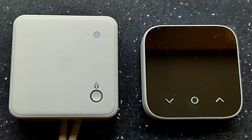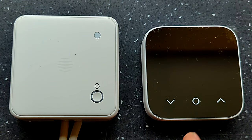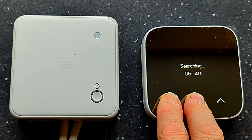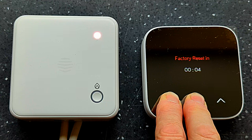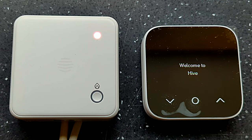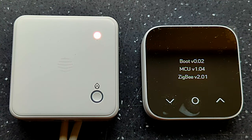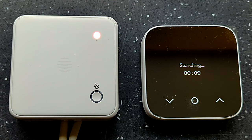Now if you can't get the two units to connect together, here's how to do the factory reset. The receiver unit is already in pairing mode — the light is flashing that purpley-white color, one second on one second off — and you can see the thermostat says it's been searching for over six minutes. All you need to do is press and hold these two buttons together. In red writing you'll see it says 'Factory Reset' and it counts down 10 seconds. Keep your fingers on the two buttons until a Hive symbol comes up on the display, then release. The thermostat is now reset to factory settings and going through the startup process, searching for the receiver unit. On this occasion the thermostat found the receiver within 24 seconds.